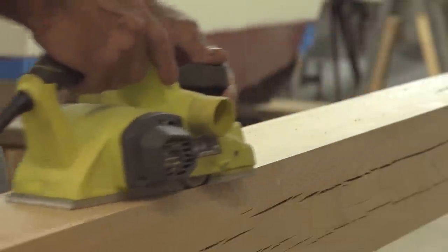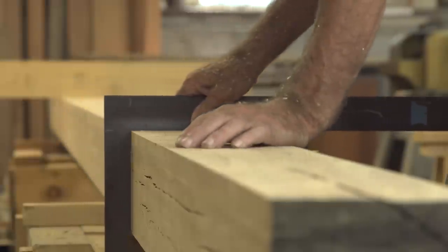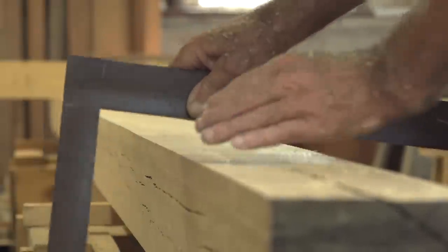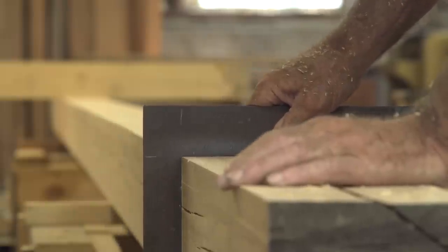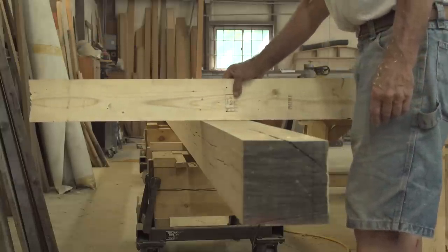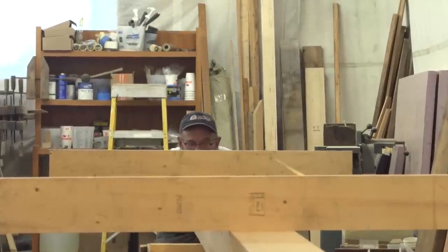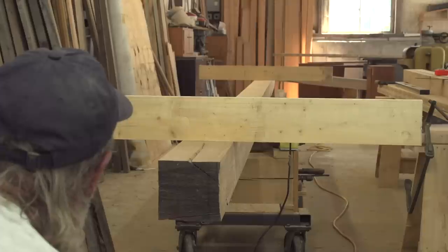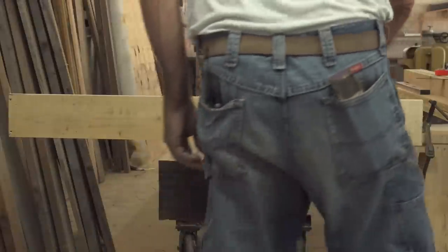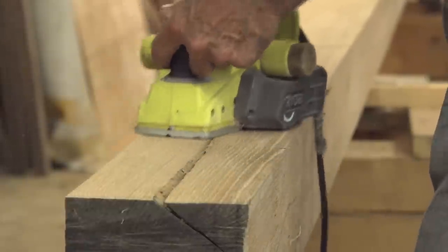What I'm doing right now is working on it. I squared up some timbers a little while back, and now I'm checking them to make sure how square they actually are. They've come out pretty nice, but they have to be much more accurate at the very ends where I'm making the scarves. You have to sight it - put a couple of pieces of wood across that are parallel to each other, look down to that level, and see whether there's a twist in the timber. A matter of thousandths of twist in that thing is going to show up on the ends in a big way.